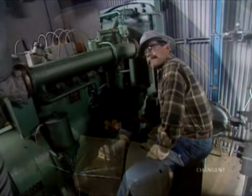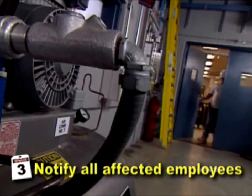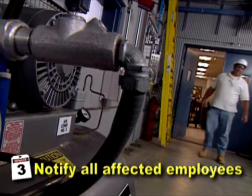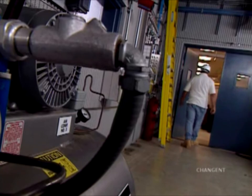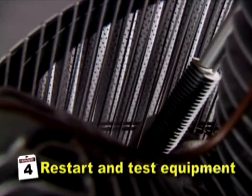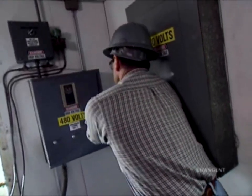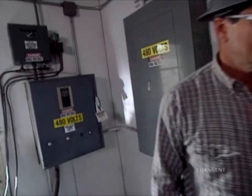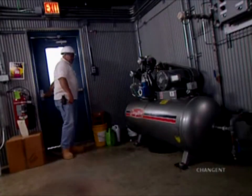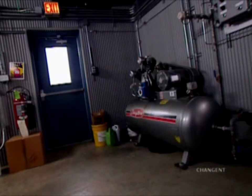All tags, except reusable types, should be destroyed after use. Notify all affected employees that the startup is about to begin. Recheck the area to make sure all safety guards are reinstalled and all tools and employees are clear before restarting the equipment. Now restart the equipment. When using a disconnect switch or breaker, stand to the side of the switch and turn your head away before throwing the switch. This helps protect you should a sudden arc or flash occur. Check for proper function of equipment and check backup and secondary energy sources. Make sure the equipment or system is fully operational.